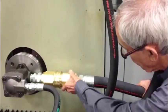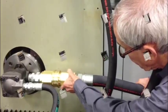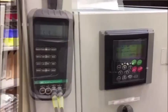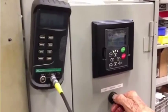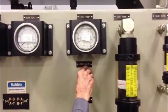Then we test the completed unit, ensuring they meet Eaton Vickers specifications. We start at 600 RPM and measure the flow to make sure the pump has taken prime. Then we take them to 1800 RPM and slowly increase the pressure up to the maximum rating.